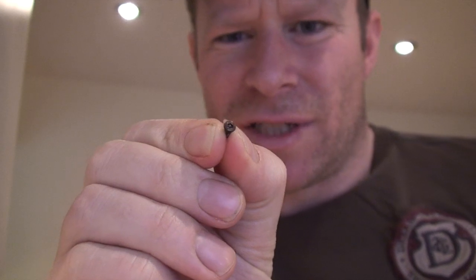I'm not particularly impressed with the supplied bolts — these little M2.5 or M2 bolts that they provide. They're too soft on the top. They sheared really easily for me with an Allen key and I had to use a Torx screwdriver head instead to get them out. I've ended up buying some more bolts with just a Phillips screwdriver head on them, which I find far easier to get tight and get out again.